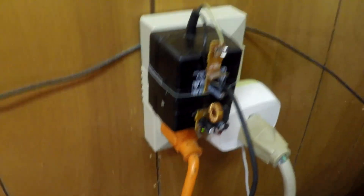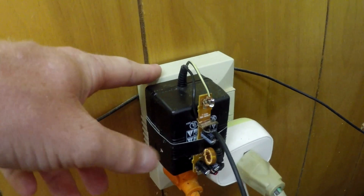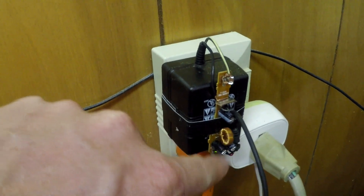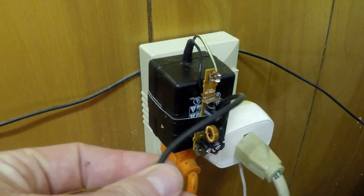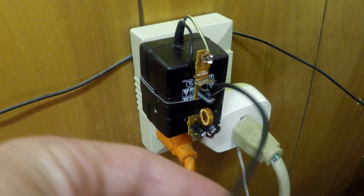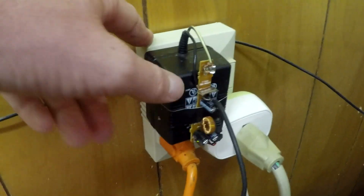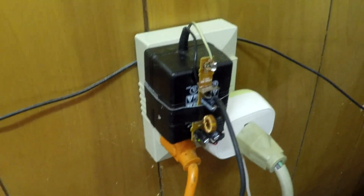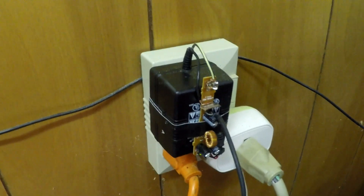So first I'm going to start with the power supply. I've got a 12 volt transformer that goes from 120 volts down to 12 volts, and then from that to a cigarette lighter car plug transformer that goes from 12 volts down to 4.5 volts for some sort of charger I found. I just made this up from what I have in my shop — so altogether it goes from 120 volts all the way down to 4.5 volts. This way I can just have it plugged in rather than running on battery.